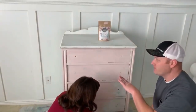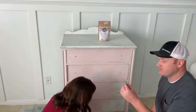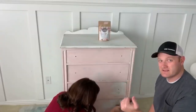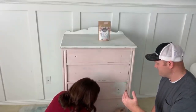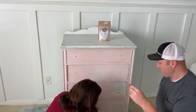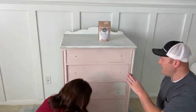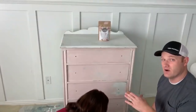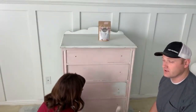She's going to get this painted real quick — we're going to do a first coat. Usually with milk paint, depending on how you mix it, it does tend to be a little thinner. If you let it sit longer it'll thicken up. It's been about 20 minutes and it's still thin. On the first coat you're going to look at it and think, oh my goodness, all these brush strokes. But once you get the second coat on with milk paint it's really smooth and a lot of your brush strokes are going to go away.